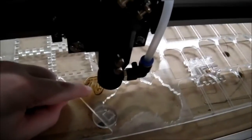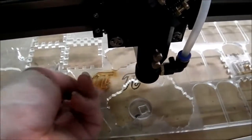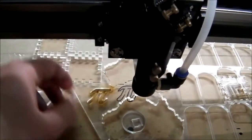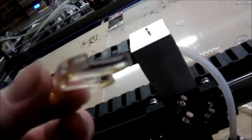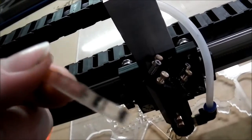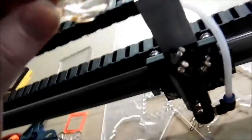And there it is. It probably won't fall out because it still has the plastic protective sheeting on. As you can see the MDF has made it kind of messy looking. If we try and pull this out — see the focus is really good now — it's actually kind of difficult to get the parts out. You can still see a few lines in the edges, but if you slow the speed down and lower the air assist a bit it'll turn out much better.